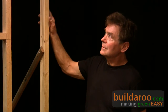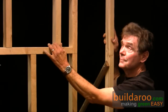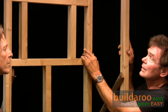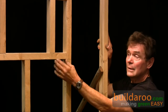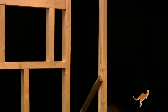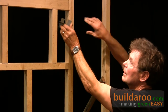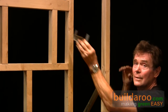Back to you, Terry. So let's start with what advanced framing actually is and how you get a reduction in lumber. This is a window opening — this is a header above it — and in typical framing, you would put a trimmer under the header and a trimmer all the way down underneath the bottom of the window. In advanced framing, you eliminate that. You hold the headers up with metal clips. If this wall was full scale, it would fit this clip. So rather than put a large piece of wood all the way down, you simply put a metal clip up to hold it, and your headers are held up by these metal clips.